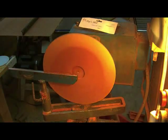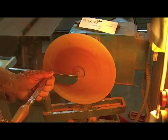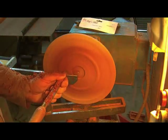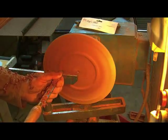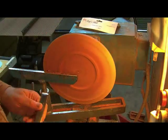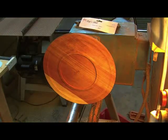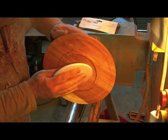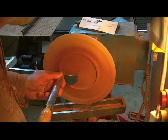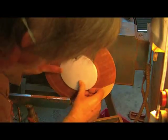We have turned the platter around and I am just squaring the face. I am just about to get rid of our holding point in the lathe, but once I have got the lines in and the centre ceramic fitted, I will recut that so I can remount and turn the platter around again to square off the bottom. That holding point goes underneath the ceramic, so it is not an issue. When we finally glue it up, we make sure there is a nice padding of hot glue underneath to ensure there are no weak points when putting pressure on the middle.